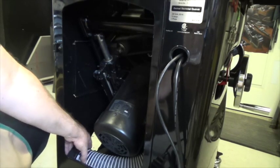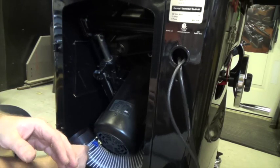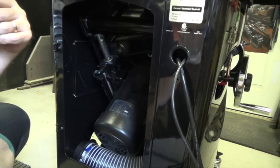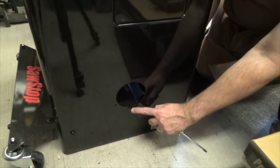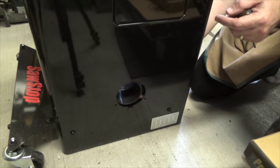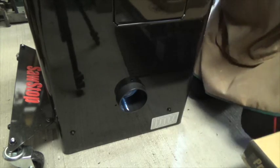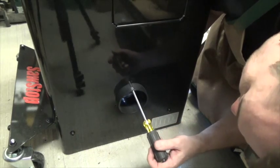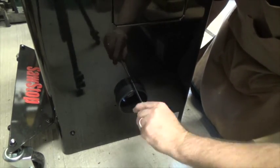The dust port connects through a hose that goes up into the blade assembly. There's a little key that aligns it. Moving to the back of the saw, there's a hole for dust collection with a little key that aligns with the dust port. Line up your dust port, make sure the key lines up, and it extends through the back of the saw. Then hold it firmly against the saw and screw these screws into the back with a Phillips screwdriver.